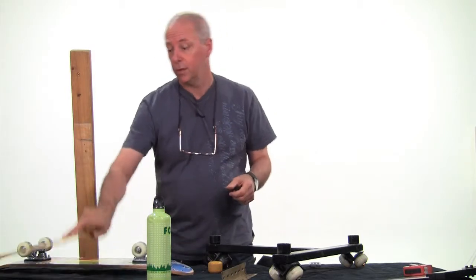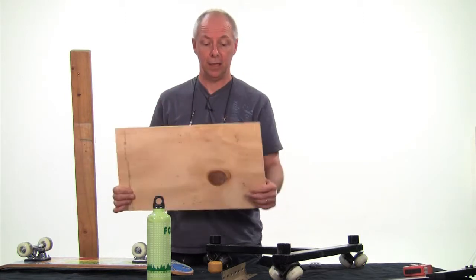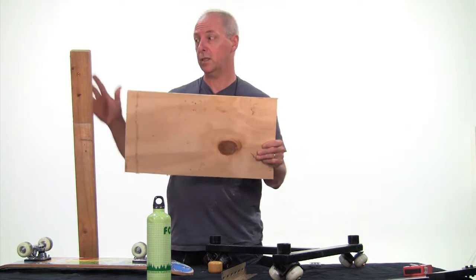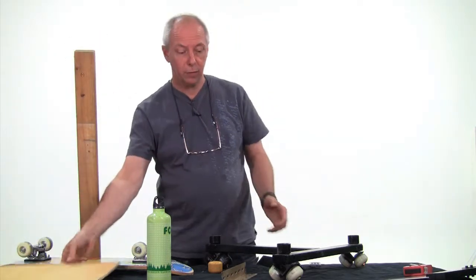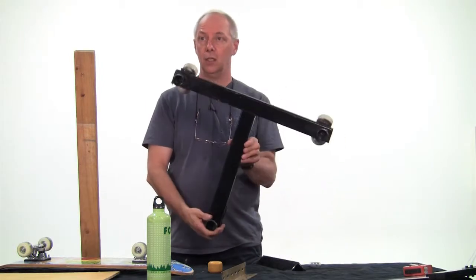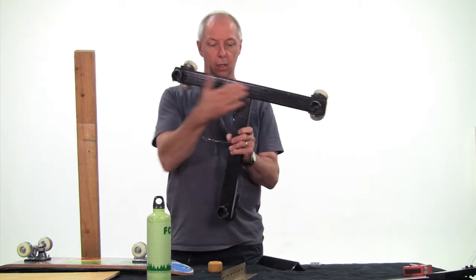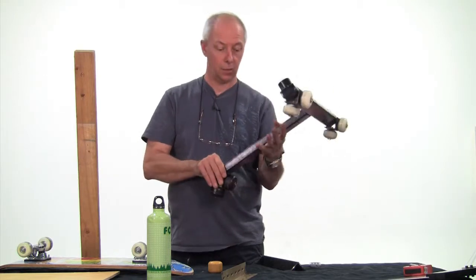We're going to need a scrap of either plywood or some MDF. We're going to be making some triangles out of this, and we'll be using the triangles to brace this piece of wood to the adjoining piece of wood. So we're going to have to form a T-shape. So we're going to have to cut the wood to make a T-shape, and we'll use the plywood across here to form a triangle to reinforce it, to make it a little bit stronger.